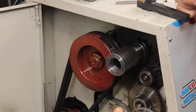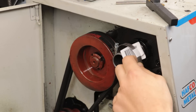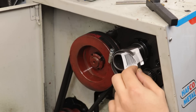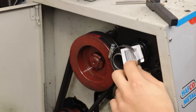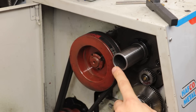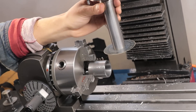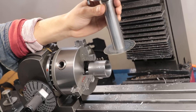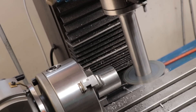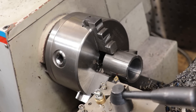The final plan was to use some hose clamps to hold everything in place. I've done this method before and it does work, but unfortunately the pulley spacing meant there wasn't enough space to fit the hose clamps where I was hoping to. As a compromise I had to bring the clamps forward to clear the pulley, with fingers crossed it was going to work. The next step was to get in the dividing head and use a slitting saw to cut in about six slots, allowing the sleeve to act sort of like a collet and compress in a bit.